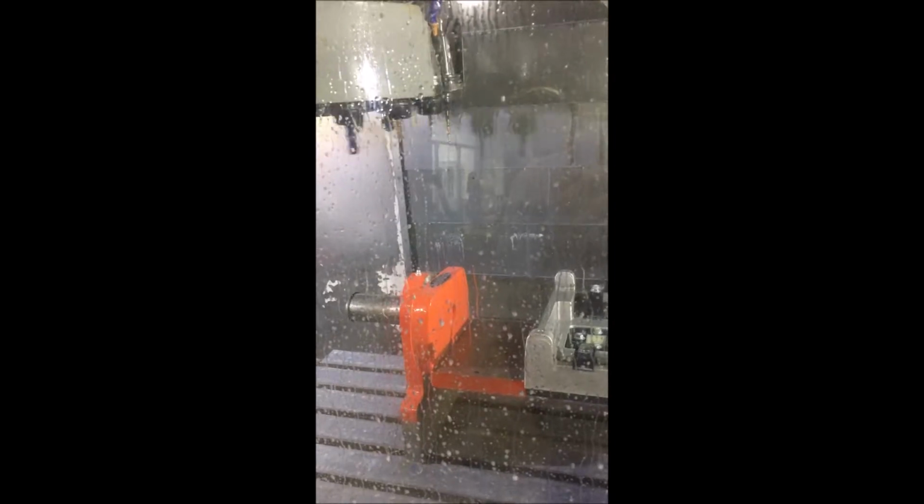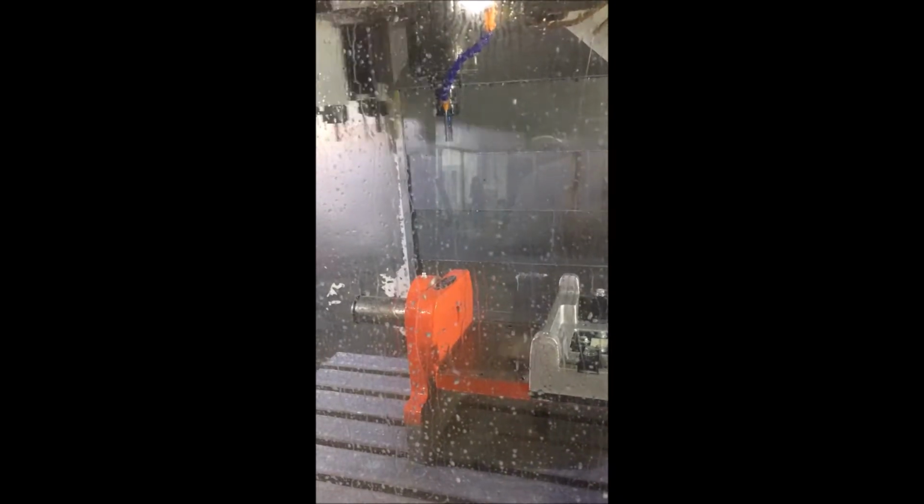And now we're done drilling and tapping on the top side. Now we're going to come and grab a big old bull end mill, and we're going to mill the inside of the carriage slots, so when you press in the bushings, they're not wonky. This is where if we had the probes, it'd be really nice, because then we could get the center line of the carriage even better than this jig does. And I did notice that the casting is not equal thickness. That's pretty fast, isn't it?